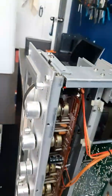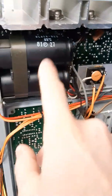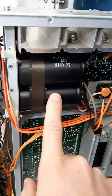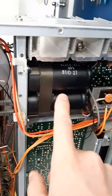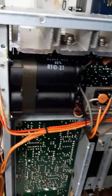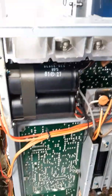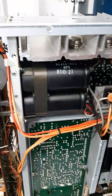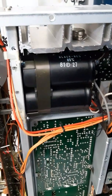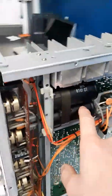The previous report mentioned it's not that accessible, and that's absolutely true. These are the two main power capacitors, and I would absolutely have to remove them to get there because the components are behind them. I'd have to bleed them out to remove any charge inside them to do this safely.